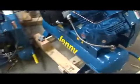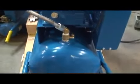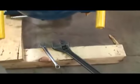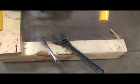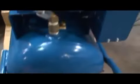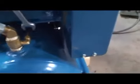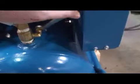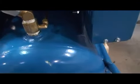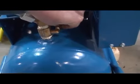Okay, here we go. Now, this isn't a terribly complicated repair. You don't need a lot of tools for this. Here I'm just going to use an adjustable wrench and a 1/2 inch end wrench. I'm kind of cheating here. I've already gone ahead and loosened these fittings, but you'd use a 1/2 inch wrench here to loosen the fitting on the copper compression line. There we go. Just loosen and remove that line to the side.